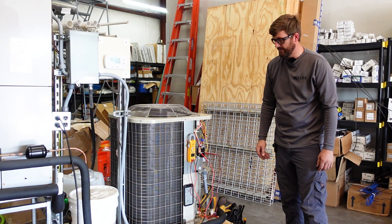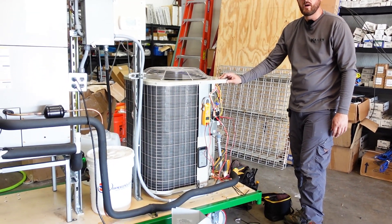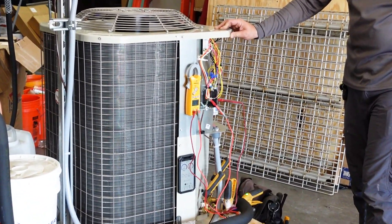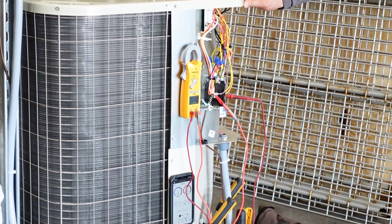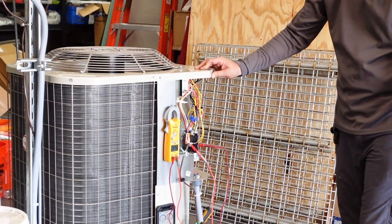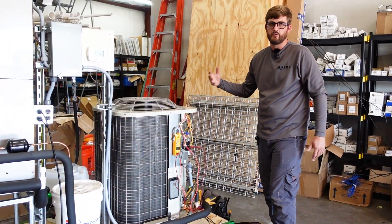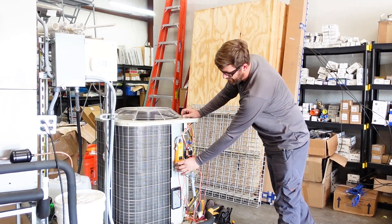Typically they run fine, but it's still good to correct this issue when you see it. You can definitely run into more problems if the control wiring is longer and/or undersized, and depending on the voltage drop of how big the site is — because you might not be getting 208 to your unit. You might be getting on the low end of that, and then in the afternoon the power can drop even lower, and then you'll get that nuisance call that the AC is not working at five in the afternoon. Just something to definitely look out for.